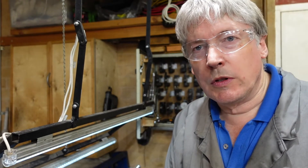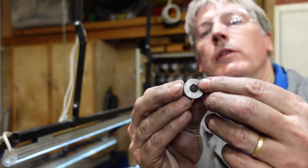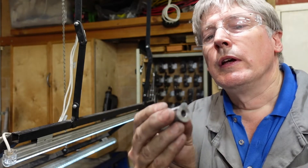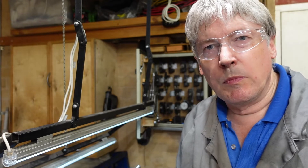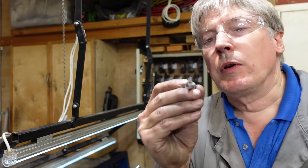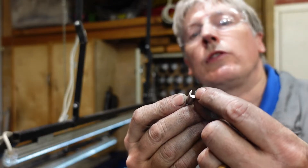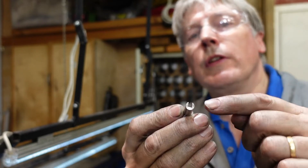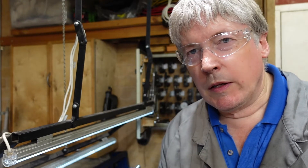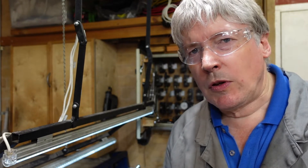I'm on the home stretch now. The major problem was there's a 1/16th of an inch wide keyway — that's a little bit over one and a half millimeters for metric folks. I have a 1/16th broach, but I had to position that broach. I didn't have a 1/16th bush suitable for that bore size, so I had to make one — and this is where the trouble came in. If you look carefully, you may see that it's not quite symmetric; this side is a little thinner than this side. It's only 0.2–0.3 of a millimeter, but it's amazing how much the eye can pick up, and if you tried to put that into the bore of a gear you'd have all sorts of trouble fitting the keyway. So that was out.